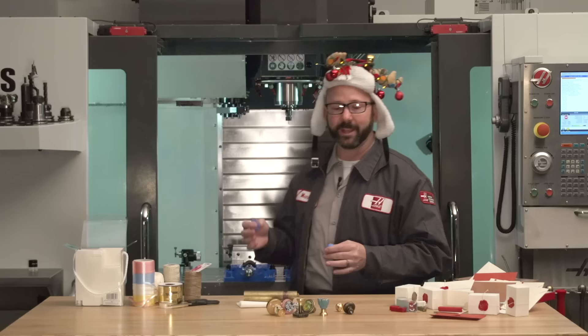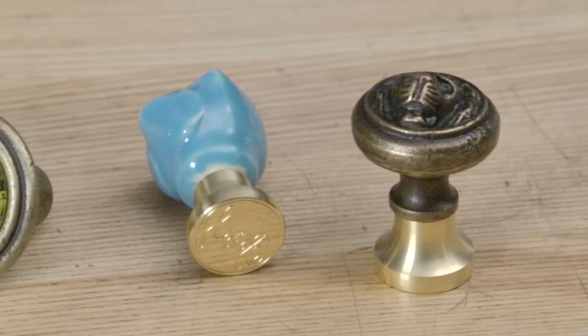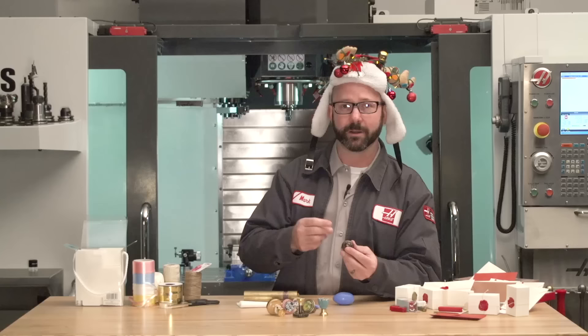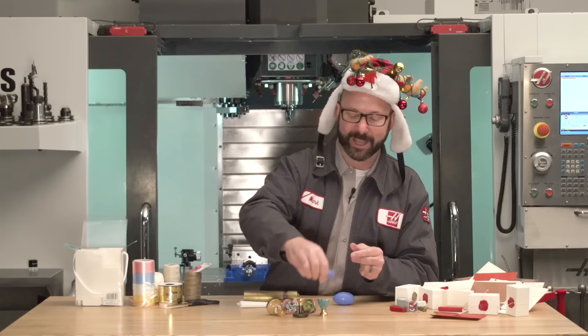Now it's time to show off my finished product. All I've got to do is screw on this stamp head that I had made earlier and already cleaned up. I just want to mention that I didn't tap these parts until I'd already bought the cabinet knobs — I didn't know what thread to tap. Don't make these things and make a bucket of them until you've found out what thread the knobs are — 8-32, 10-24, that type of thing. When I bought my knobs, I actually made an effort to get knobs that had the same threads so I didn't have to change out my tap constantly.